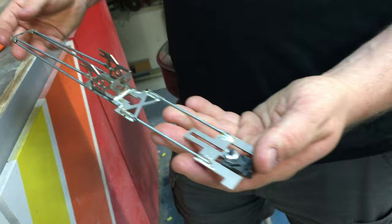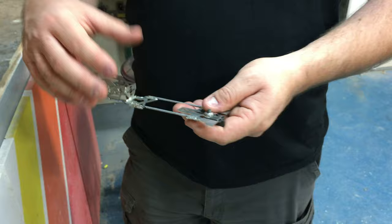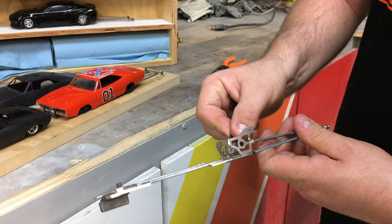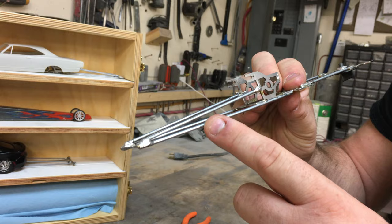When we build our cars, we actually get a chassis kit. That is all these stainless steel little plates on here that come together, that you have to break apart with a Dremel, cut them apart, clean them up a bit, and then solder it all together. Having to clean everything up, I've been using a file just to make sure that everything fits nicely. And all these bars are just a rod that I bought at the local hobby shop here that you use for RC planes. They're the right thickness. It's still lightweight, and you just solder them on here. This length here will depend on whatever your taste is. Some people would only have it here. We'll show you later on one, then we'll compare it to this one.